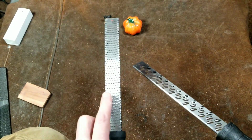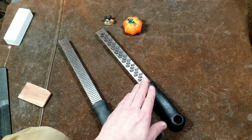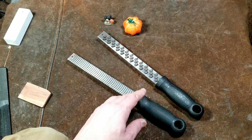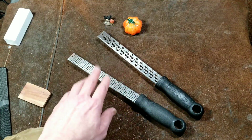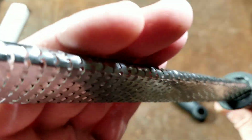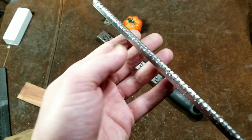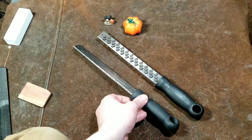And then you can just hit it with this side. And you say, well, you're finishing out drywall. What's nice about these is that you can have a particularly ugly or uneven section of drywall and just flush it up a little bit, and it makes everything else look a whole lot smoother. And on this one, I do like the way the little cutouts go around the edge, so you can actually get right up in a corner and kind of get a nice round corner, and it'll file it out. And it just gives you better fit and finish.